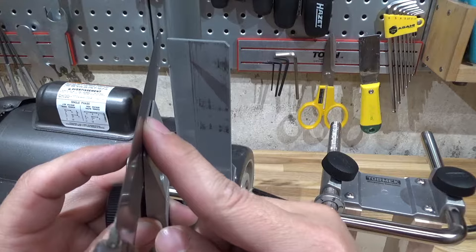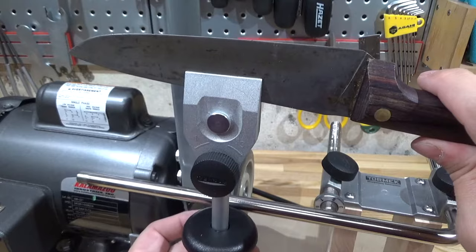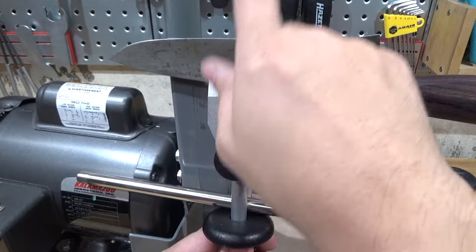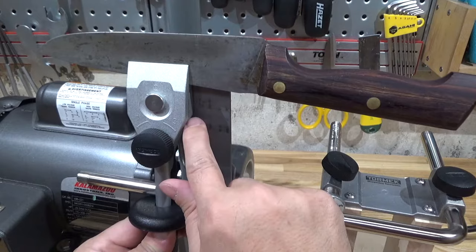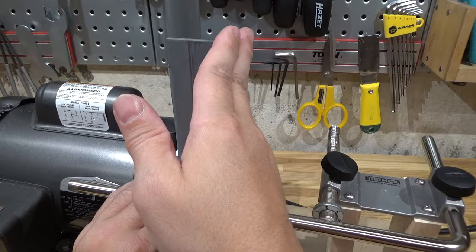It's not ideal, and even if 15 degrees was acceptable there's an additional problem with this grinder in particular: you put the jig up along the grinding bar and slide it along the belt, but it hits the motor. So this jig and this grinder don't work together. The good news is that this bar makes freehand sanding of knives really easy with this belt sander.